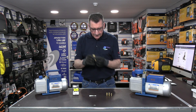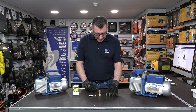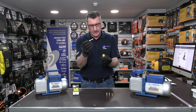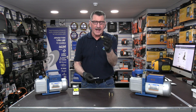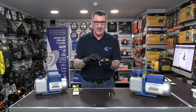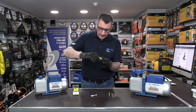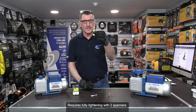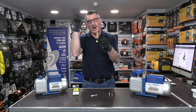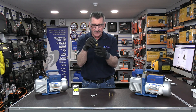There's obviously a non-return valve built into this body. In the kit you get five items: a quarter adapter, a three-eighths, a half inch, and the valve body itself with some Loctite 545 thread sealant. You choose which outlet adapter you want — in this case I'm going for the half inch one. You put a drop or two of Loctite sealant on there and screw it into the valve body. You've got a three-eighths SAE fitting going onto the vacuum pump and then on this occasion a half inch going out. I would recommend a minimum of three-eighths coming out of the vacuum pump.